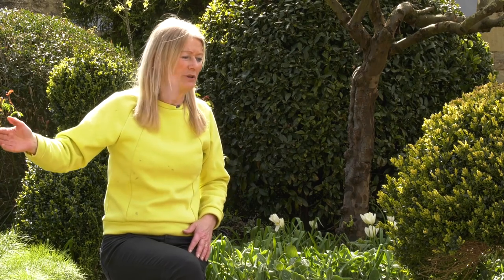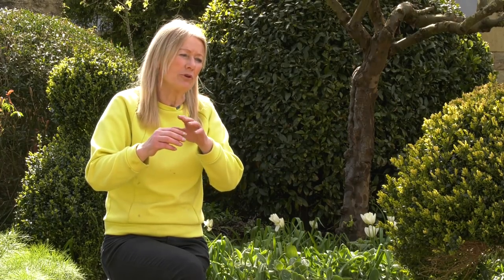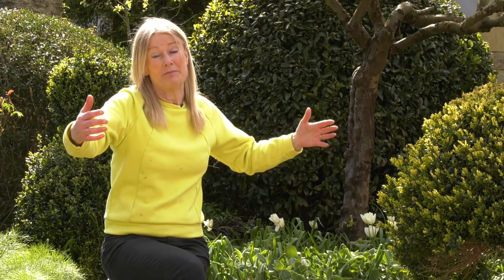Whichever way you choose, you want the basic footprint of the buildings, the driveways, the trees, the paving, everything you want to keep, marked in the accurate position on that survey. Now, the OS map won't give you the position of all the different trees. It won't give you the exact position of the finer detail. So from that plan, when you've blown up the ordnance survey map, say to 1 to 100, you then need to plot the other items yourself.